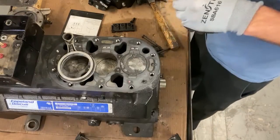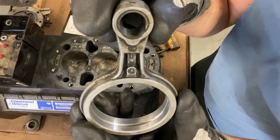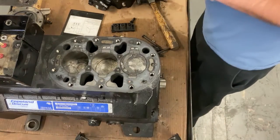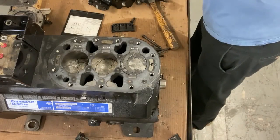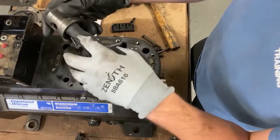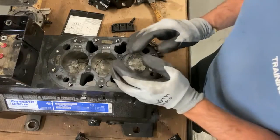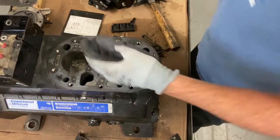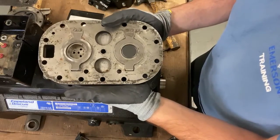Maybe hard to hear there, but this is exactly what happens. Right here, if you could hear that, that's wrist pin wear due to busted discharge, not getting enough oil up into the piston, wrist pin, and you get a failed wrist pin. And if you get a knock in the compressor, and just say all of a sudden once, oh, I just got this busted, the cylinders look good, but I'll just replace the valve plate.